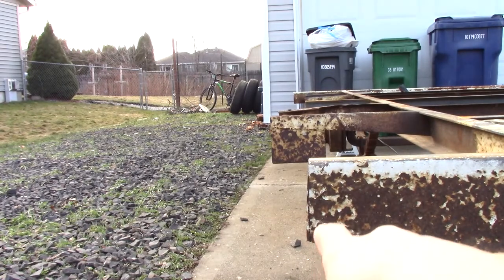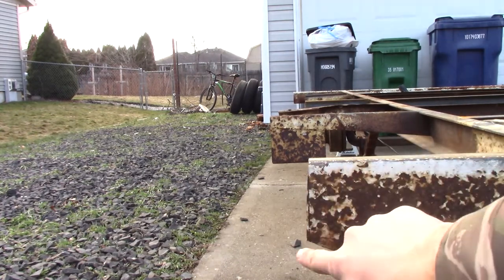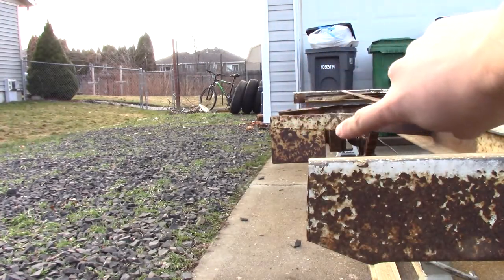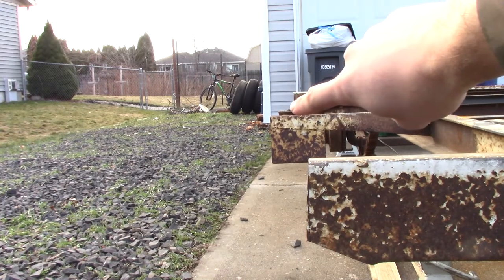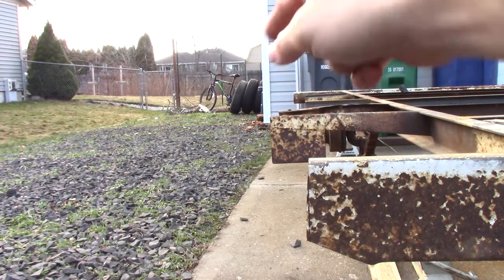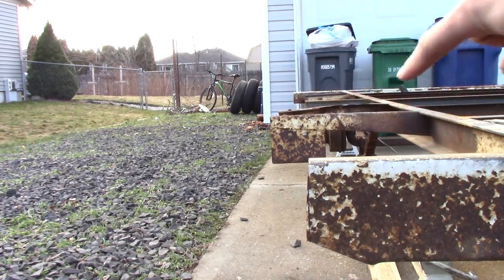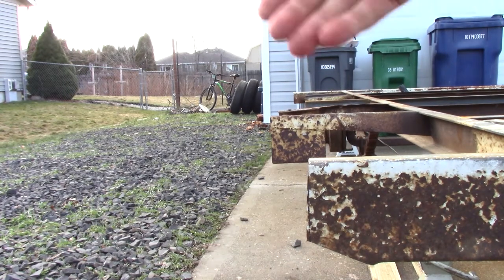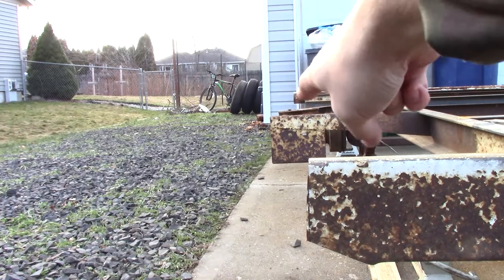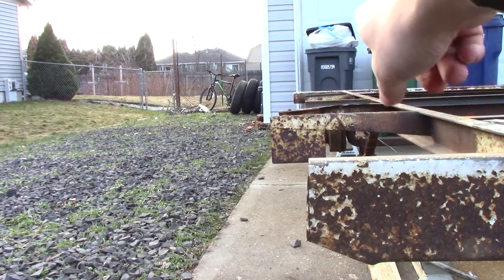Here on the other side of the trailer you can see the outriggers at their original full length — a few inches longer out here. The reason these are still full length is because I had to get the step off first. The only door to this trailer was right here, that's where the step was. So I have to remove the step, then go in and cut these extra pieces off, and weld in the support with the last two pieces of short angle that I have.